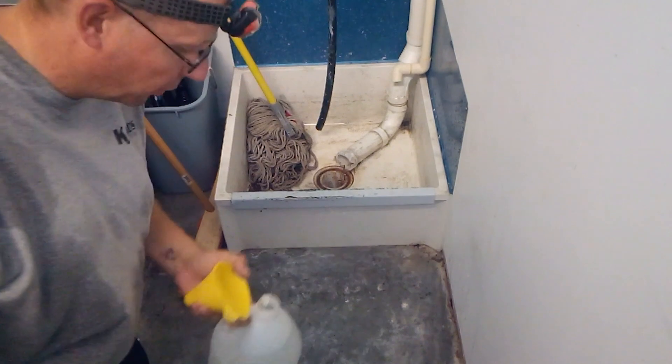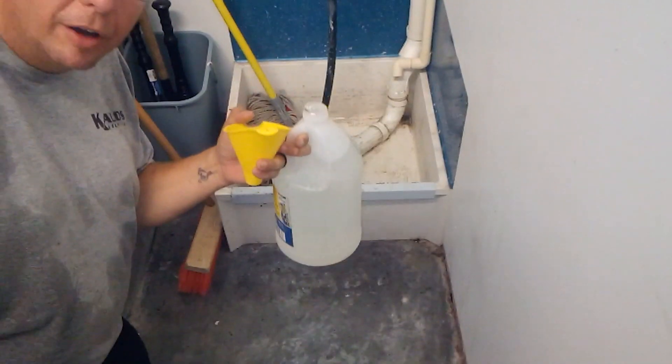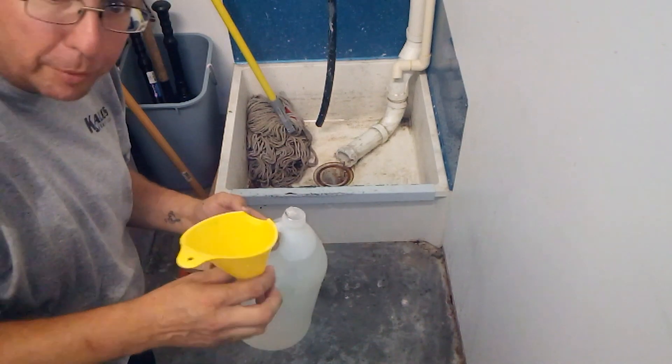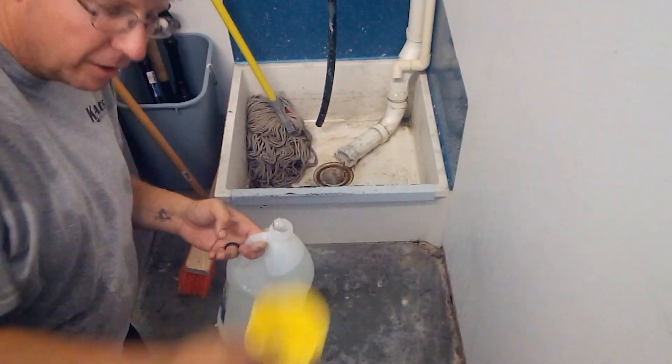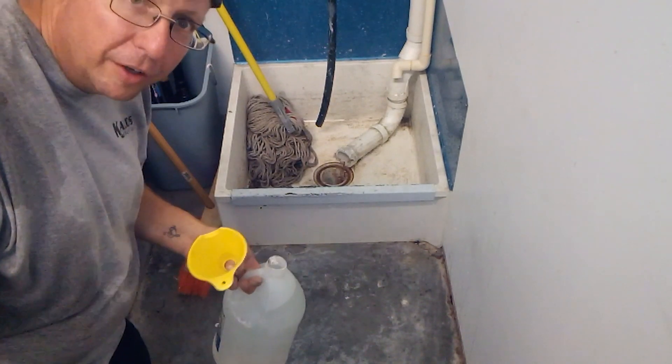What I've done now is I've resorted to getting water as hot as I can. This will be now the fourth time I've gone and put a fitting on the three-quarter pipe that's feeding this inch and a quarter. I'm dumping it all down there with this funnel. The last time, I started to hear movement of that slime. Let's see if we can get it this time — I bet it comes out.